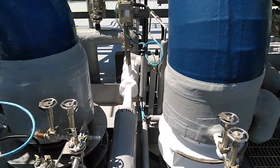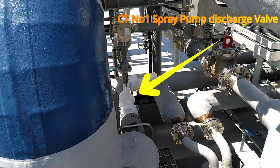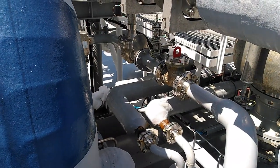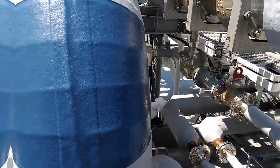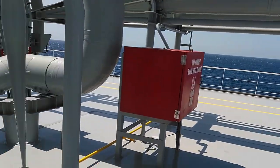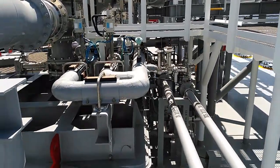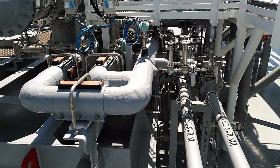From the filling line on the starboard side is the discharge line which is coming upwards, and forward of it is the discharge valve. Then we have the spray nozzle and the starboard side nozzle. Leaving the tank now and going from the forward part, you will see the valves which are located there.